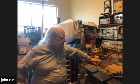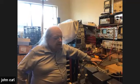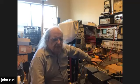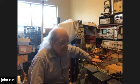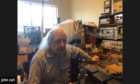And it has been done, and it's been forgotten by many, many people. A lot of the test equipment doesn't even bother. Even the latest stuff, the most expensive, they don't seem to bother with all the different kinds of distortion they could measure. They just say, well, nobody's bothering us about it. We'll just give you the harmonic distortion and keep lowering the level. This is like a minus 100 machine. I said, well, we'll give you minus 140. Well, what is that? That means it's 100 times lower distortion than this was ever designed to do. Good. But does it tell you anything useful? I don't think so very often.